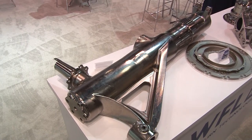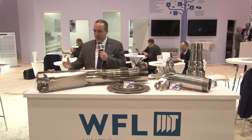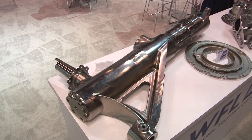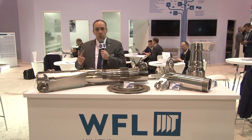This part was machined on a WFL complete in two clampings in one cycle. The challenge with this is the work holding — how to fixture and hold the part — and we were able to do this entire part complete on a WFL Mill-Turn with no manual intervention other than one switch-around for the second clamping on this particular part.